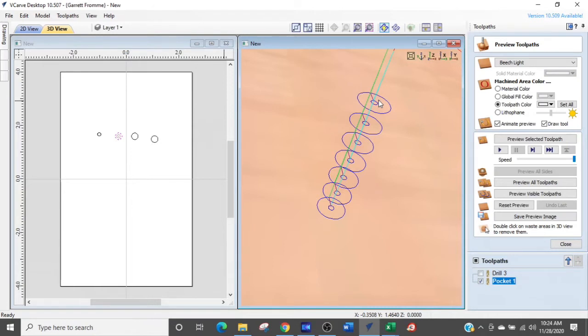setting. And the step over means the percentage of the diameter of the tool that is going to step over from center line to start doing its cuts. So you can see this is doing 7 passes, and for each pass it comes down into it feeds down to the first circle. It interpolates around. Interpolate is an interesting word, but that's the word they use in machining.